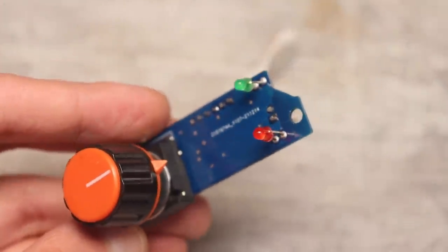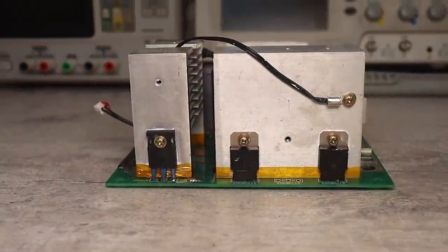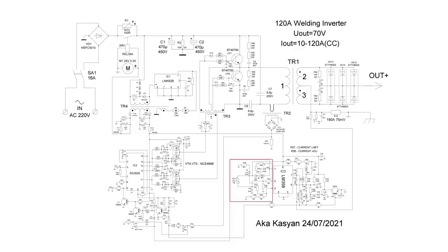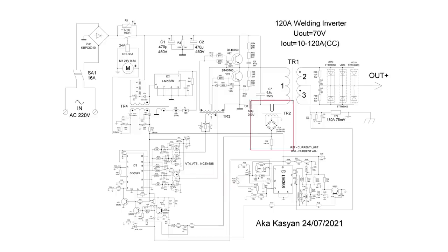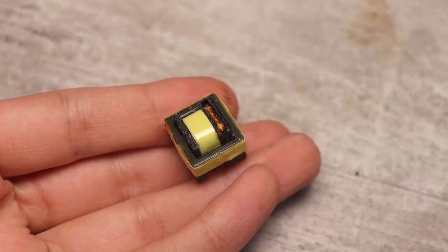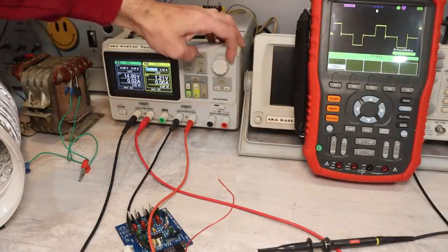Of course, we can manually adjust the current value. There is overheating protection which is built on the second channel of the operational amplifier. The sensor is a thermistor. Protection of overlimited current. This node will save the power transistors if, for example, the current feedback is faulty and the current isn't limited.